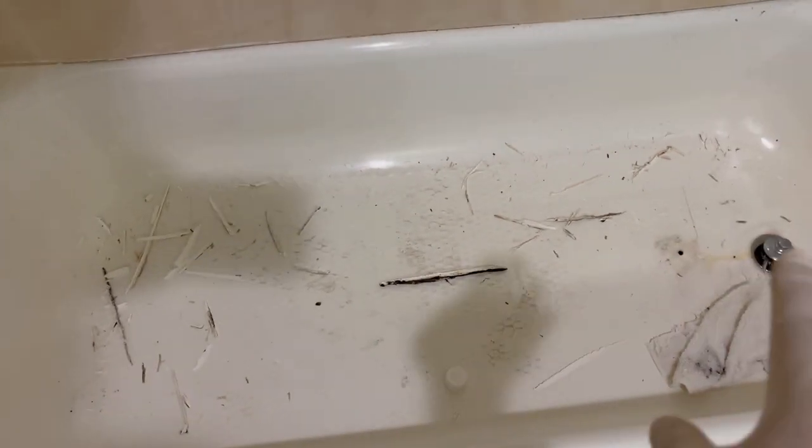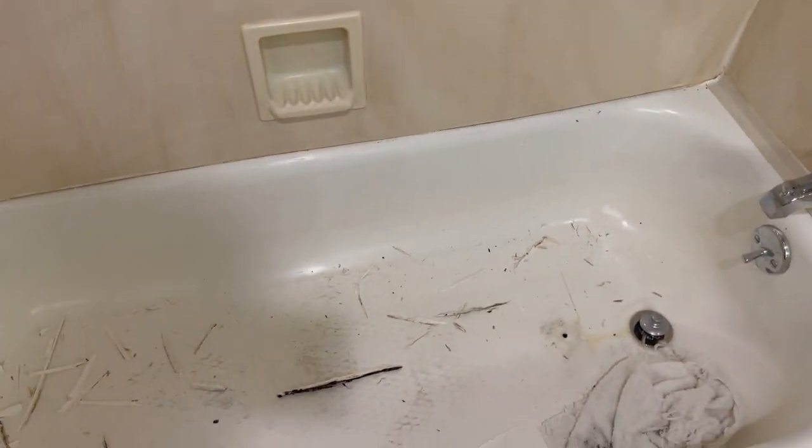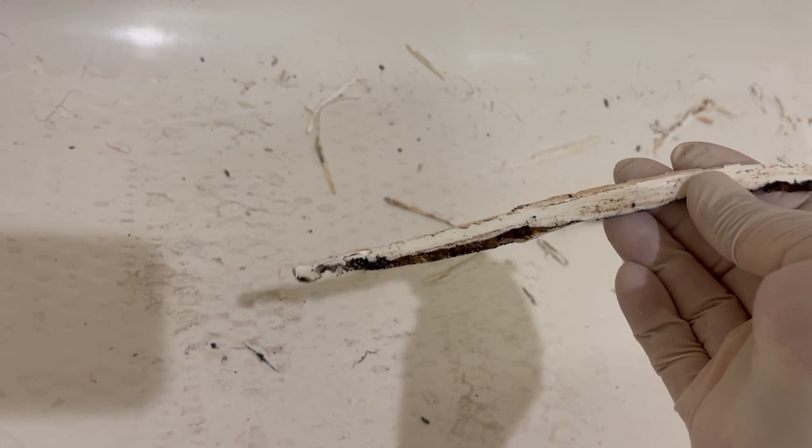We removed all the old caulk, and just like I said, see the mess that it makes? So now we'll clean all this up real nice, put the new caulk in. Of course, before we put the new caulk in, we gotta clean it real nice to get rid of all the debris. But this is one of my pet peeves, guys — see this? This is layers upon layers upon layers of caulk. This is what happens if you leave the old caulk and just put new caulk on top — you're gonna get mold. Whoever's doing new caulk now is gonna have a hard time because it's buried in there.